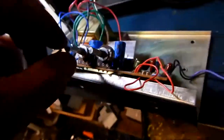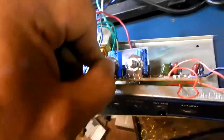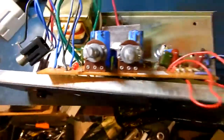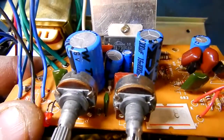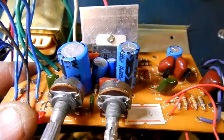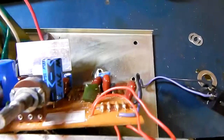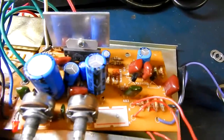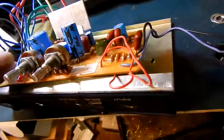Someone's had a problem with it for a while. This other pot is kind of tight too, but I'm hoping I can get a little oil in there and loosen it up. It's probably all it is — the oils have dried up from sitting in someone's basement. There's the chip — it's a TA7205AP, made by Toshiba. It's mounted very precariously; a little bit of vibration and it'll bust the pins. I don't see any swelled-up caps though — this one here is questionable.